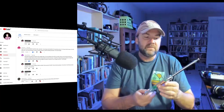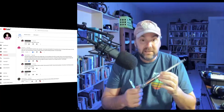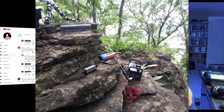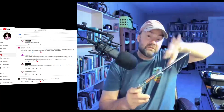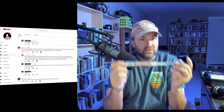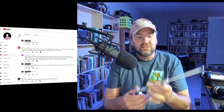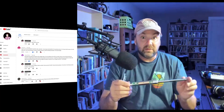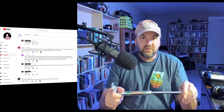Another thing about this antenna: I went on a hiking expedition last weekend and made two more contacts with it, just like that — boom boom. It's very good for that. But this is a daytime antenna — it does 20 meters, 15 meters, 17 meters, which are daytime bands. As soon as the sun sets you lose 20 meters and have to drop to 40 meters, and this doesn't do 40 meters. So you're limited to daytime operation only. I got poor signal reports — a 439 and a 549 — but I did make contacts.